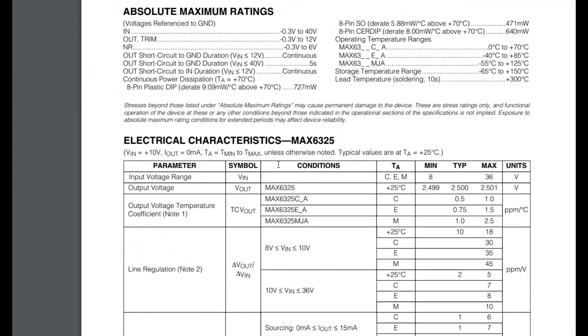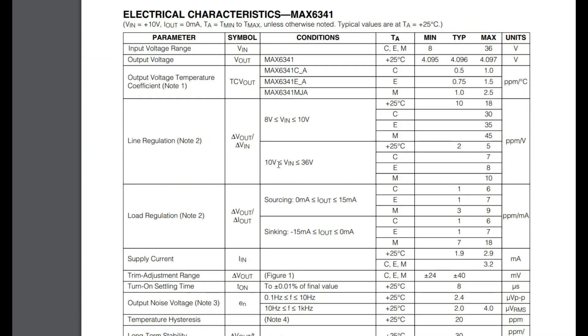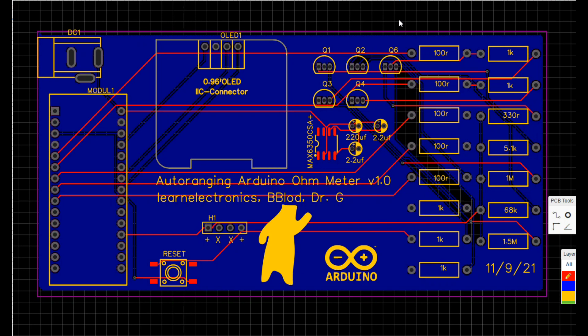Here's a typical operating circuit — it simply has in, out, and ground. We put a little bypass capacitor in there and that's really all there is to it. Here are some features on it if you're interested. I just wanted to point out that that's the IC we're going to add into this board. There's not going to be any outwardly noticeable effect of adding the IC — the effect is going to be that the whole system is going to be that much more precise. That's what we're hoping for anyway.